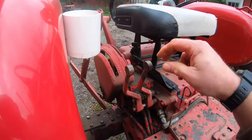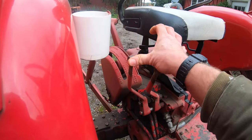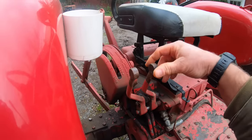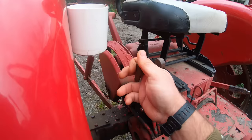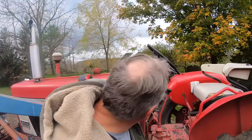The hydraulic levers don't stay in their detent positions for raise or lower. When I push the lever up it should stay there until the cylinder reaches the end of its travel. This one works sometimes and other times it doesn't, and overall they're harder to work than they should be — they take more strength to pull to the operating position. Finally, this tractor has governor and carburetor problems. It wanders RPM-wise in the field. When you're going uphill the RPMs slow down, and going downhill they speed up. That's indicative of play in the governor — probably wear in the linkage rather than the governor spring.